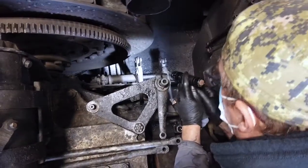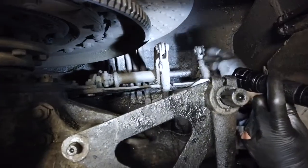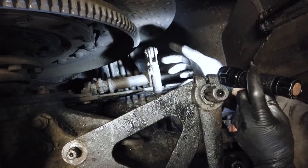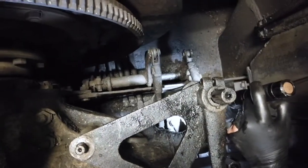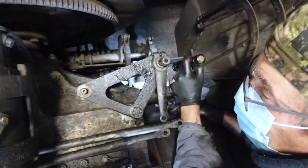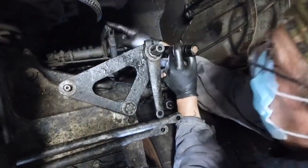If you look, there are two linkages — one and two. This one here will press in or out the clutch that's in this drum. The outside of the drum is the brake drum, but the inside of it is a clutch, and that's this lever.